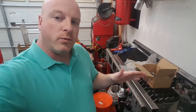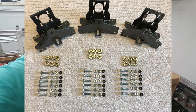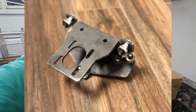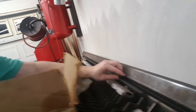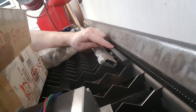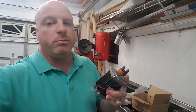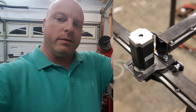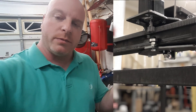To get our X and Y axis, what I've opted to do was get a kit where you get plasma-cut parts that you weld together to make your carriages. Those carriages run on rails — in this case the rails are going to be 2x2 box section. It's a rack and pinion system. We have our stepper motors, and we need gears to match that rail section. The gears on the stepper motors interface with the rail section with the gear teeth cut in it, giving us our X and Y axis.